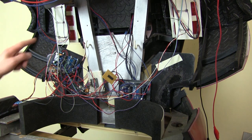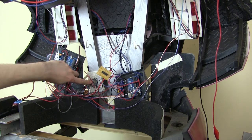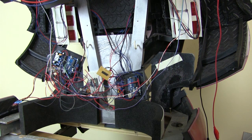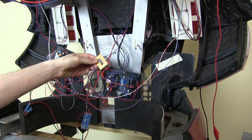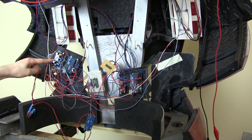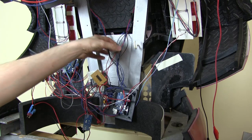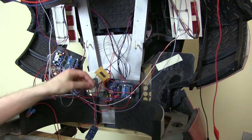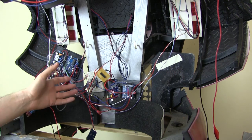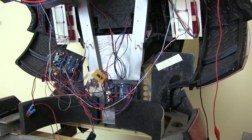This is what's in here now — basically two Arduino UNOs and an Internet of Things device which is a Photon from Particle, which needed internet connectivity to connect and operate with a smartphone. So I'm taking that out and putting a Bluetooth device in. We've got some other things floating around: power supplies, a Darlington array, another power supply — those are all voltage regulators. And obviously there's masses of wires going everywhere trying to control all of the NeoPixels, all of the servos in those guns up there, the motors and everything. What we're putting in is the control system I built last time, which is much more of a node-based approach — so all I'll have to do is have one master Arduino, run a big power wire to everything, then five volts, ground, and one data wire, bringing all of these wires up to nodes placed around the suit.